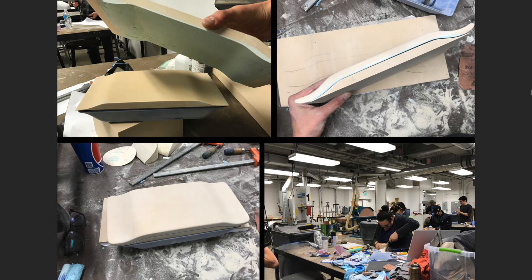In the top left picture, I used a bondo squash method where I put bondo on the top part and put wax on the piece of foam underneath. When applied together, the bondo keeps the shape but does not stick to the top piece. After sanding and sanding, I was finally happy with the shape that I had got.